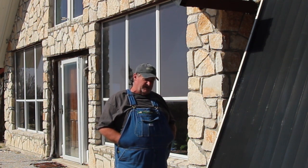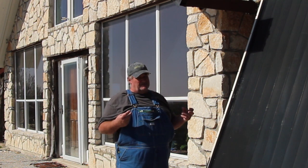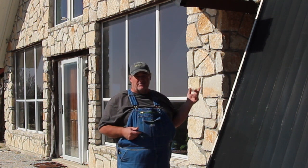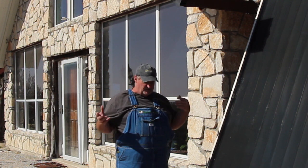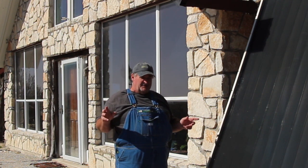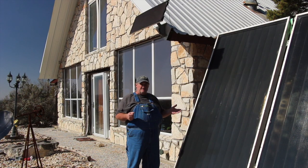And if you do radiant floor, that's the wonderful thing about it: central heat and central air blows the heat or the air around in the house. It shoots out vents into cold rooms. So you got hot air shooting out, mixing with cold air. You got swirling going on. You got heat transfer between cold and hot air. You get your own little weather system inside the house, and it can be unstable.